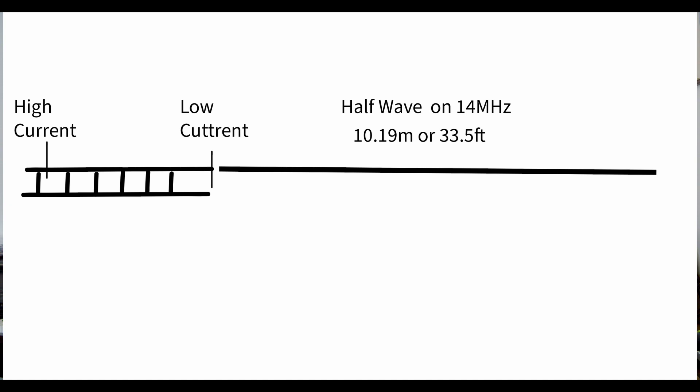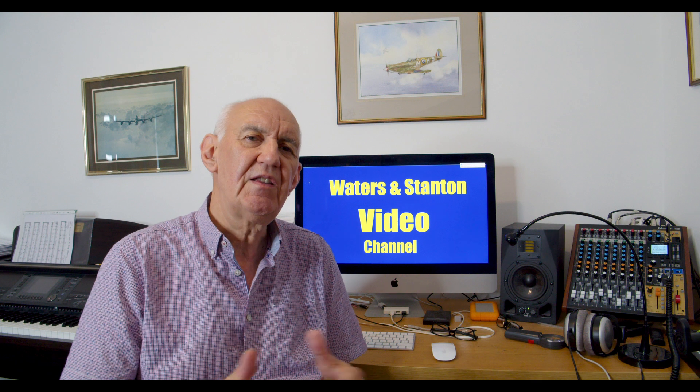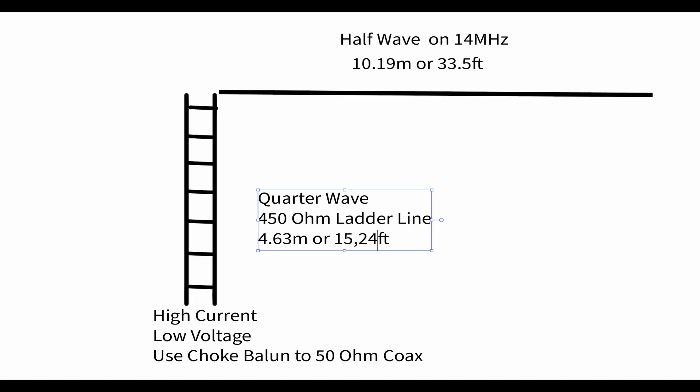So we've got a half-wave antenna trailing out of our balloon, then 450 ohm ladder line, and at the end of that ladder line is a nice high-current point where you connect your coax cable. Here are the dimensions and layout of this end-fed half wave, with the ladder line coming down vertically so the antenna can be erected at around 15 or 20 feet above the ground, and then your ladder line comes down and you're ready to make the connection.